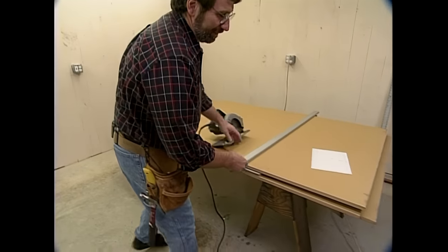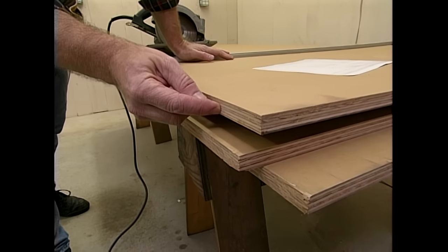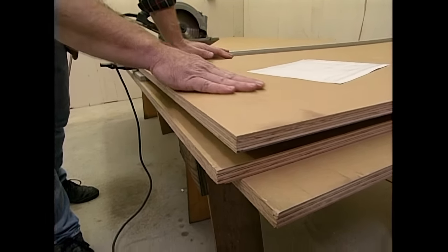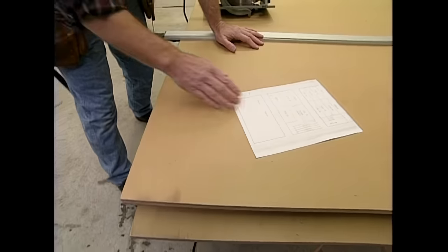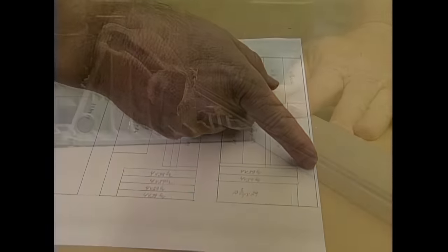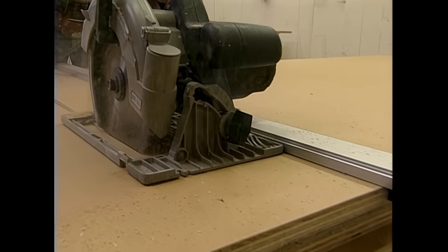Let's get started with this pile of plywood. It's MDO plywood — medium density overlay. Plywood substrate with a thin paper facing on each side. You can buy it at a well-stocked lumber yard, a home center, or call your plywood supplier. You can leave it unfinished — it's nice and smooth — or you can paint it, and that's why sign painters like it so much. Whenever I work with plywood, I make a plywood cutting diagram to get the most out of each sheet. It's difficult to handle full sheets, so I'm going to make some initial cuts with a circular saw. I've set up a straight edge clamp and I'm just going to let the base of the saw ride right up against the clamp for a nice straight cut.